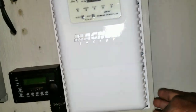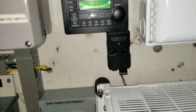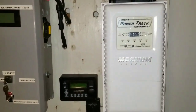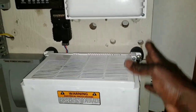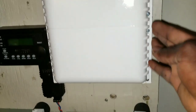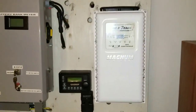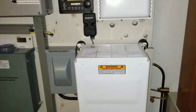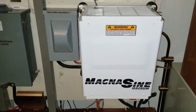That's the Battery Monitor Kit — the BMK — so it's going to be tying into the shunt. This Magnum unit here is going to anchor on the side of the box. See, there's a conduit knockout here you can take out — there's another one here which the load center already has. That's going to give a complete system. This is going to be on the side of the load center with the conduit knockouts attached, and it's going to be a giant system, just like we have for the Outback.